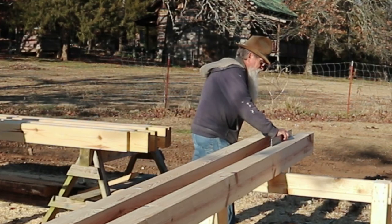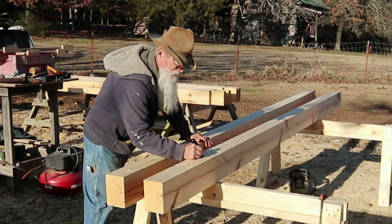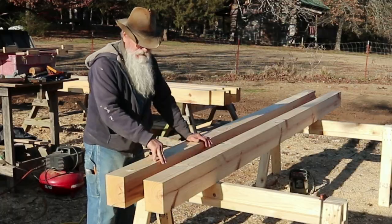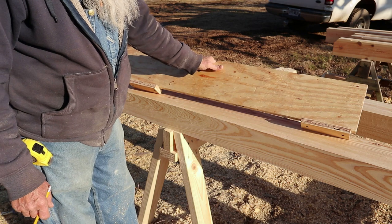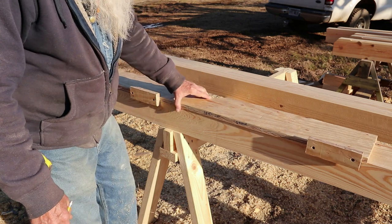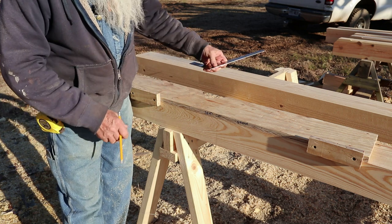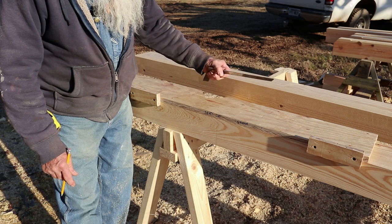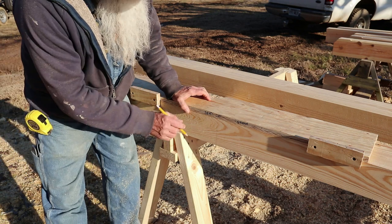On the tail, I'll go ahead and mark where I'll actually cut it on the end. I'll use the big saw for that. I'm going to write a number four — this is the way I'm numbering these so that I can keep these two rafters together. I'm using a template. It's just a piece of three-quarter-inch plywood with a little catch piece on the top so I can use it on both sides of the rafter.